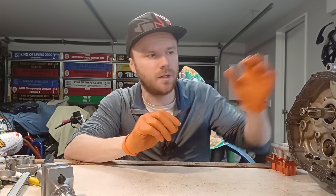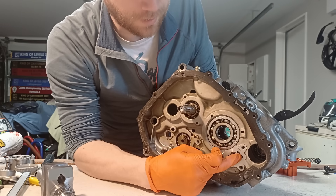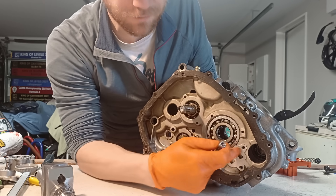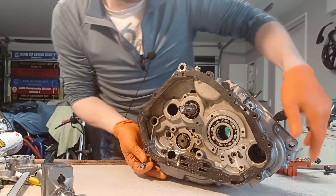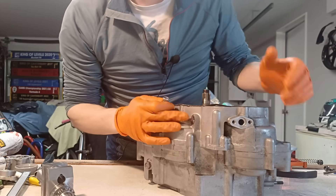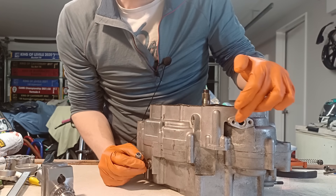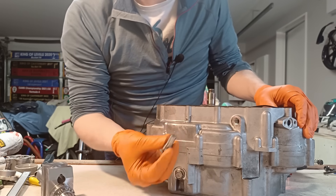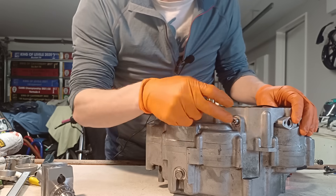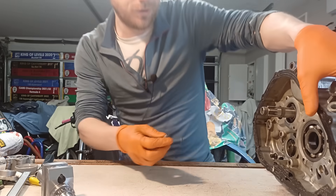That's a little bit of a pain on the crank cases here. The pickup side goes through the pump and comes out on the pressure side, but there's nowhere in the immediate vicinity where I can put this valve. I have come up with a plan though: on the bottom there's a blanking oil gallery for the pickup and this is where the feed goes straight to the oil cooler, so I'm going to make a small adapter linking the two. I've bought some drills, reamers and taps so I'll actually be able to fit this in the crank case, with a small banjo bolt connecting them both.